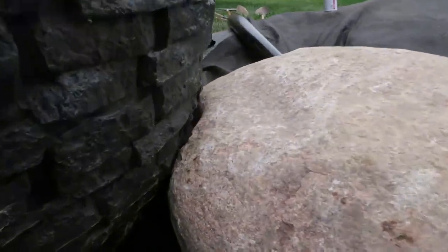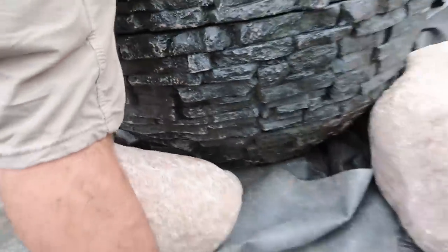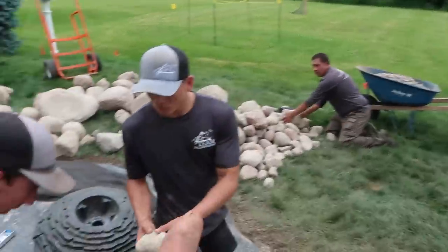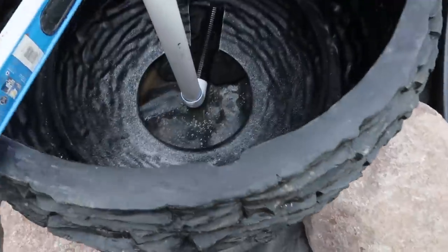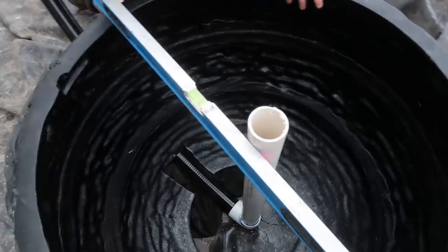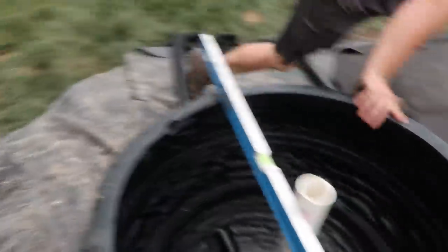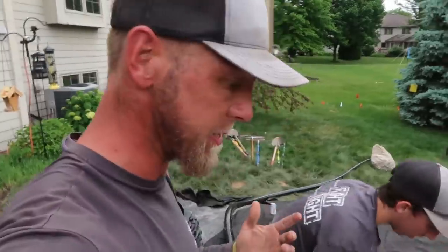One thing I wanted to show you is really nestled boulders. I found a handful of rocks that actually had these concave cuts in them — that was just the way they were made. You can see this one right here has kind of a semi-circle that tapers down so it nestles into the bottom of that sphere super well. I think it's more natural and more thought out rather than putting a big blocky rock next to something that's more of a spherical shape. We've got Luis, Jonathan, and Jack filling with cobbles, making sure the sphere stays in the center. We're also running our light cables out through a little notch cut at the bottom. The two-inch flex pipe runs out the back, and we're going to run all of our plumbing around this way and figure out a nice area for those ball valves and manifolds to sit somewhere convenient.